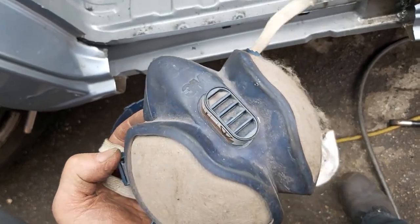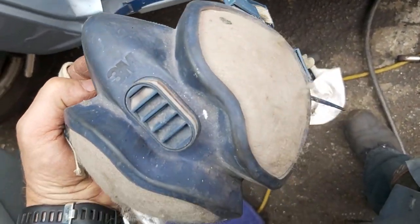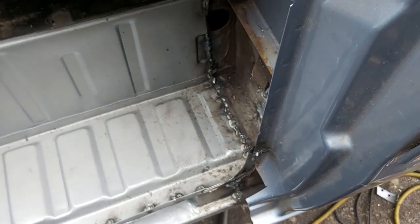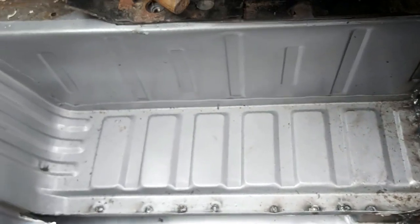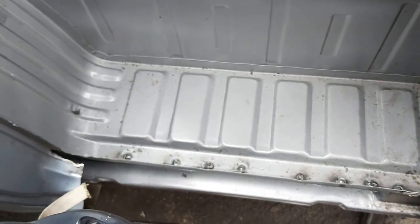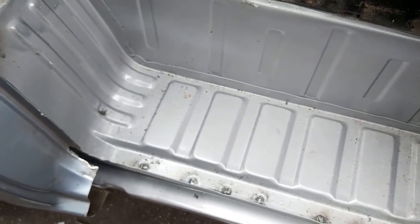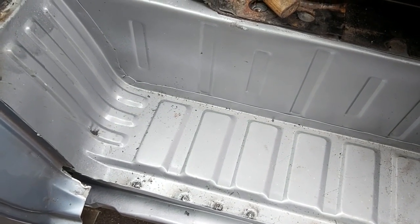This is the mask I use for spraying paint — it's low profile, made by 3M for organic vapors. Why wear a mask when welding? Because it's galvanized — galvanized will give you very poorly lungs with all that zinc. A lot of these things may kill you straight away or take years to kill you, so let's choose to avoid that by masking up. On a hot day it's a pest, but think of the future.